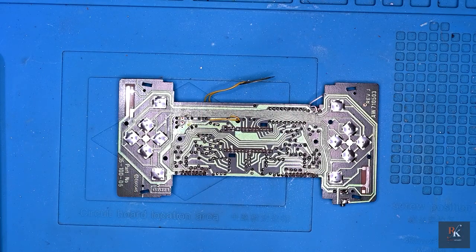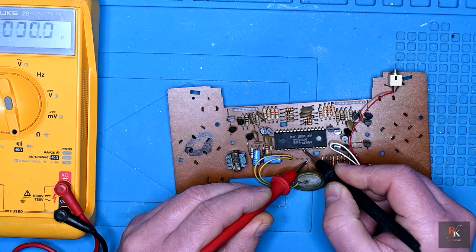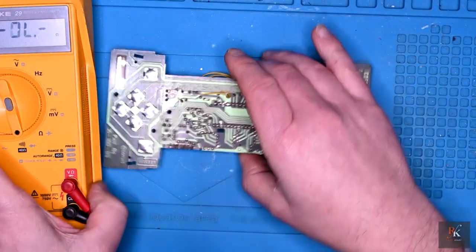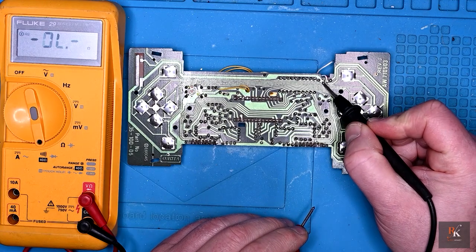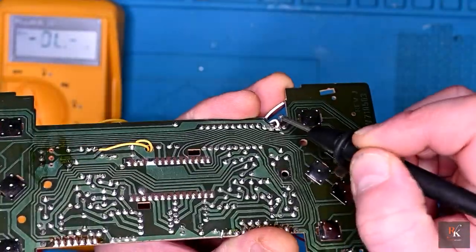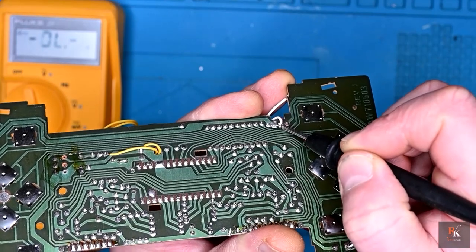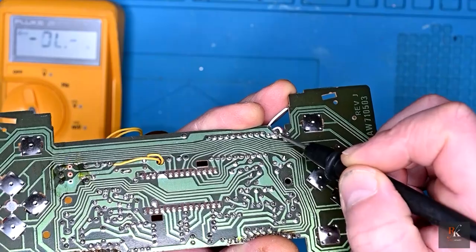And with the LED panel off, I can now start tracing the contacts and see if I can find a break anywhere in the wiring. So I think I've found the first issue at least, hopefully the only one. Before I show it, this wire here, it looks like it's been resoldered. I don't think I can bring it much closer. There's not a lot of solder on it, and the wire, you can see, kicks to the side and sits above the other contact. It doesn't touch it, there's no short, but it's so close that it wouldn't take much for that to short. So I think somebody's redone this wire. So I need to sort this. However, more importantly,